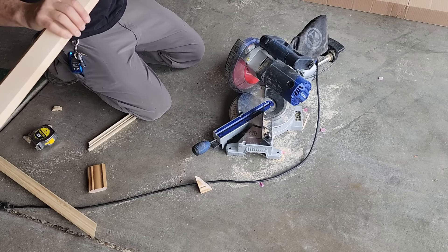And then I'll start working that outside 45 in. Get this one done, get that one done, and then it's done. So this piece that I screwed up — it is not a waste. It's going to be the return that goes straight to the wall here. So far I have not wasted any wood and I don't intend to waste any wood. But it's always nice to have some extra. You can be on the very last cut and cut an inside corner instead of an outside corner, and then you have to break into the new piece.